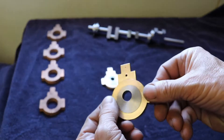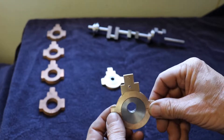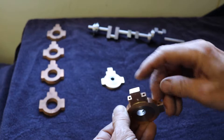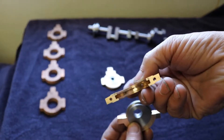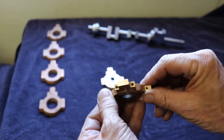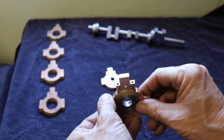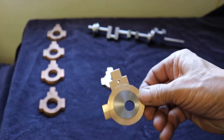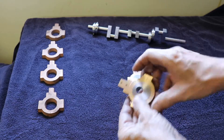This is also called a friction bearing because it can build up very high friction if it's not properly lubricated. Up here I've got oil journals. Those connect to those two little holes that you saw on the inside. In there there are little sixteenth-inch holes, and they will lubricate this quite well. I did deviate a little bit — I made the top halves an eighth inch. My theory being: more oil and more lubrication the better on a friction bearing. That's how I've done all of these.